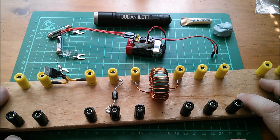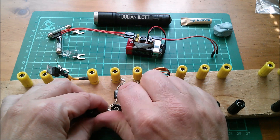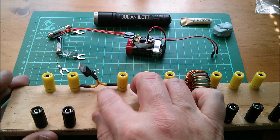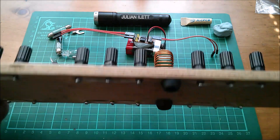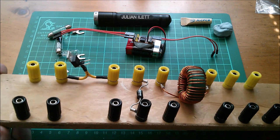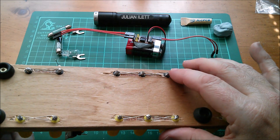So I've just been working on this breadboard today. You've seen the inductor and the Schottky diode — I've bent it into a rather interesting S shape, S for Schottky maybe, but mainly so that I can undo these and just get the thing out. And I've made up a MOSFET which has the gate and source connections on little Arduino-style DuPont pins, and thicker wires for the high-current path on drain and source. Let's flip it over — I've done the interconnecting of the closely-spaced terminal posts. There's no interconnection between the far-away spaced ones because they're the ones I'll link with topside components.